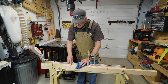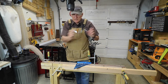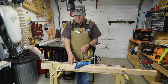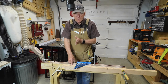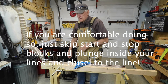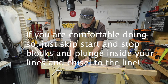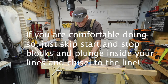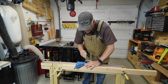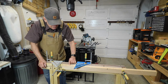In order to make sure the router stops at the ending point, I happen to know that on that part of my router — the leading edge — I have a 2 and 5/8 inch distance from the edge of the half-inch bit to the edge of the router base. This would change for each bit, but if I set a stop block there, when the router base runs into this speed square it will stop moving and stop where it's supposed to stop on that end. I get that lined up with the stop spot and clamp it down. My router is going to start here and then run until it runs into this, and that should go from here to here.